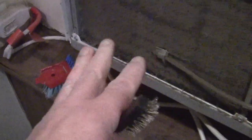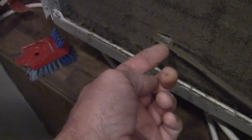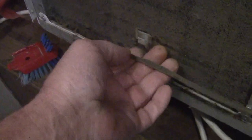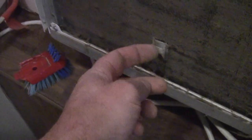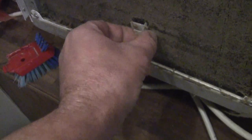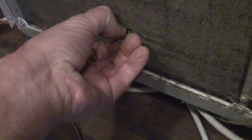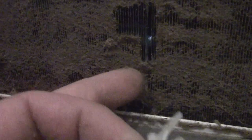While it's dry, don't spray any water in there yet. First thing you want to do is get your little thermistor out of the way. This is what senses the room temperature, or the incoming air. Get that out of the way — you don't want to damage that. And then this little clip; they all have this. Carefully pull it straight out towards you. All it does is just go in there like that, clipped around the tubing. You want to get that out of there.